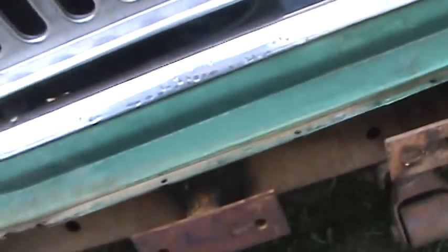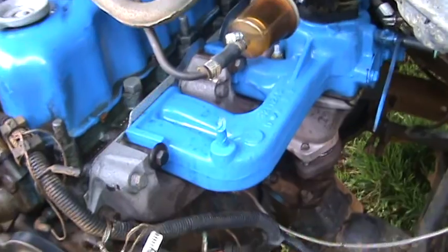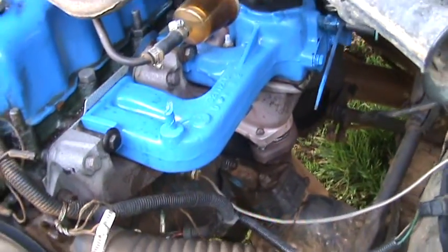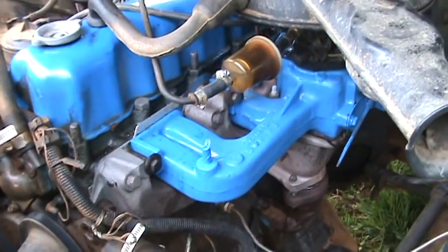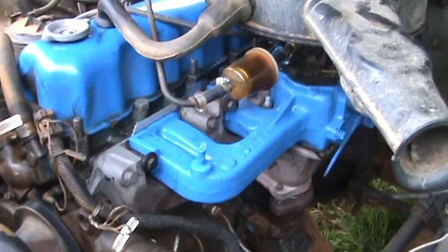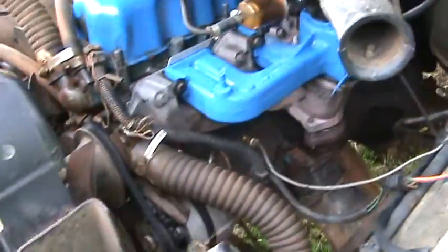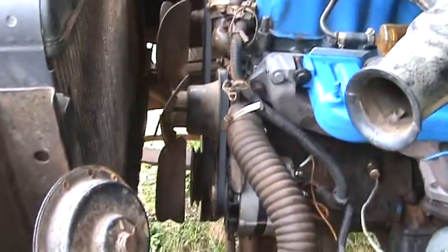All the other bolts I've replaced. I did put new shocks on it last night — you've seen them, the yellow shocks. It raised my truck up; those shocks had been on there for who knows how long. I also had to redo the intake and exhaust — put new gaskets on it. The exhaust I had to take to the machine shop to get worked on. It runs so much better; I was having a little intake leak and I could hear the exhaust leak, and I was sucking a little air.